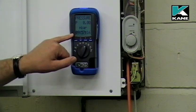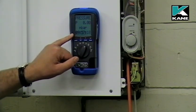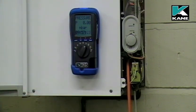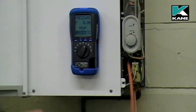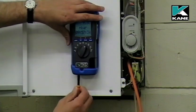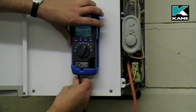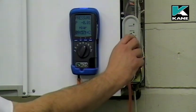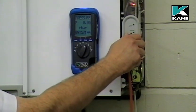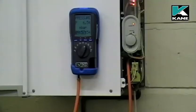You also have a clock so you can manually time a test if you wanted to. What we're going to do is set a burner pressure as per the manufacturer's instructions. Now that we've zeroed the pressure sensor, connect the hose to P1 — it's already connected to the boiler. Fire the boiler and wait for the pressure to stabilize.